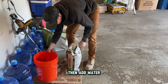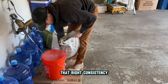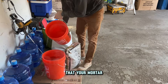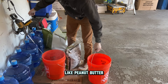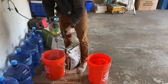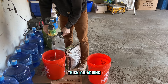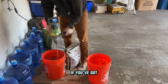You don't want to make it too runny and you don't want to make it too thick, so you kind of need to find that right consistency. For a floor like this, I would recommend your mortar be kind of like a pancake batter. You don't want it too thick like peanut butter because then it will be hard to spread and it doesn't adhere as well. As you're mixing you can play with it by adding more water if it's too thick or adding more powder if it's too runny.